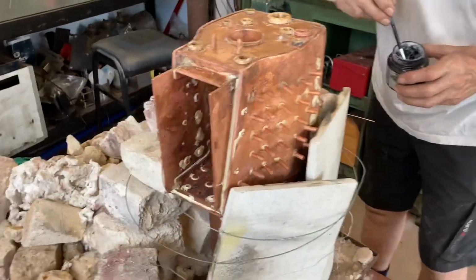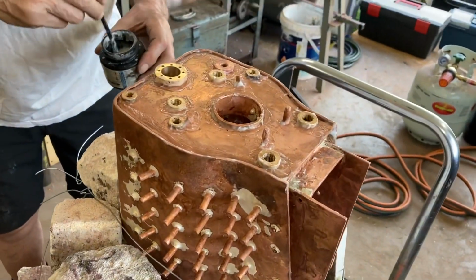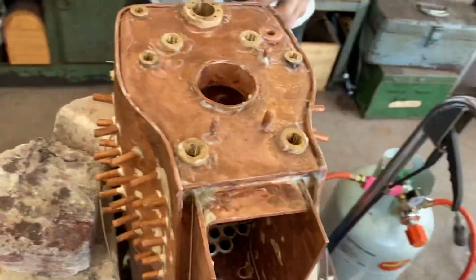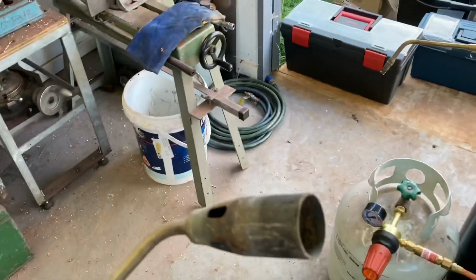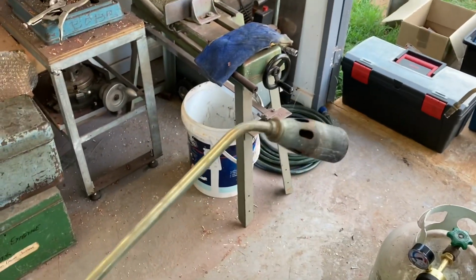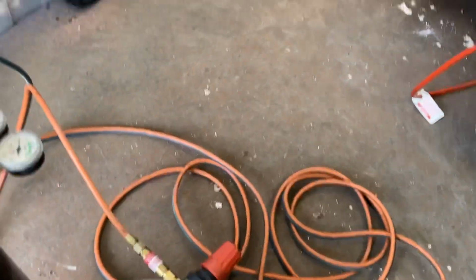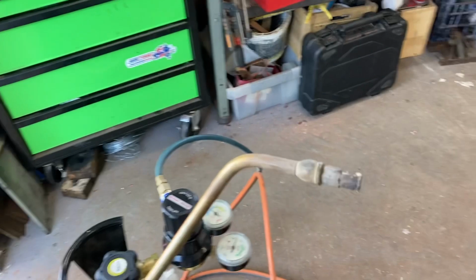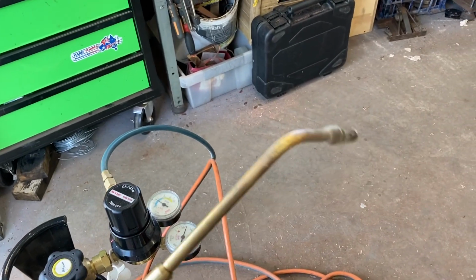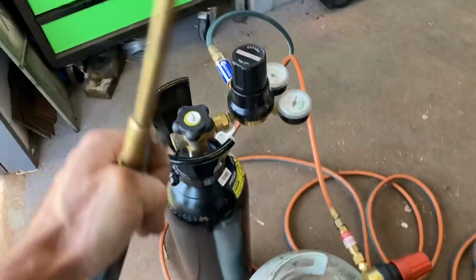So around our boiler we've put a lot of fire bricks, and these are to keep the heat in, because we're going to do the back head, but we're going to be using a 1¼-inch LPG flamethrower torch to provide the heat to get it warmed up, and then to do the detail work, as in getting the silver solder around bushes and flange, we're going to be using a Comet style, I think it's a H-tip LPG heating tip using oxy LPG.